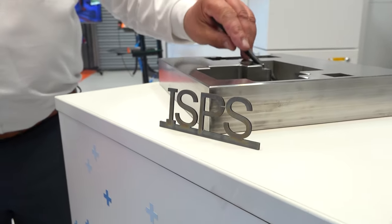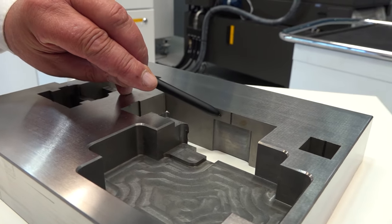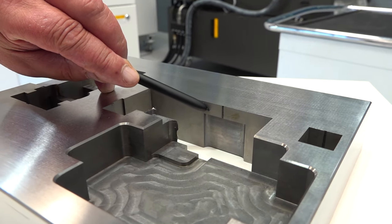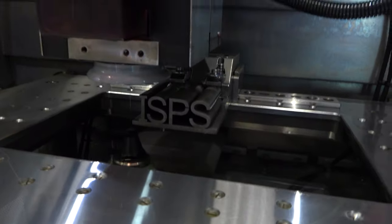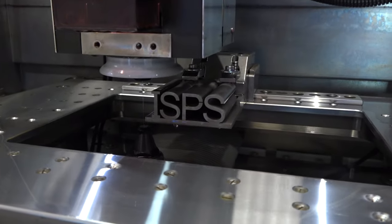Now, at the same time, the wire speed we used here, we now can use less wire speed here because it's thinner material. We don't need it to travel so fast. And we're only looking at, if we reposition to the machine there, Mark, a relatively small part, aren't we? Yep. I assume the bigger the block, the bigger the tool, then the more savings there are in these areas. Absolutely. And not just the savings, the more opportunities to protect what you see there as the wire.